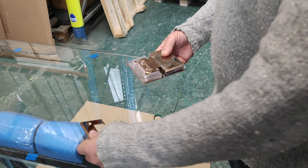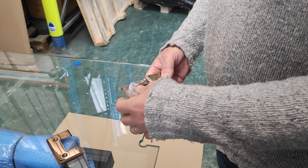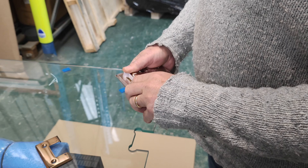As you can see, on the inside you've got some gaskets on there. Now, if it's 10mm glass, you only need one gasket each side of the glass. Sometimes they come with more, and that's because of different thickness of glass.